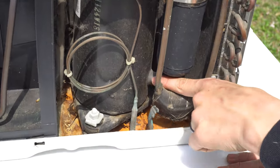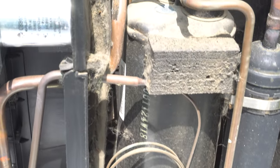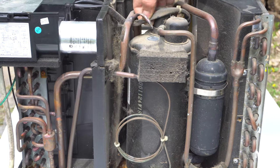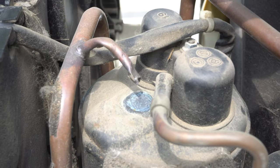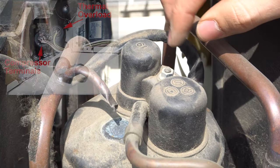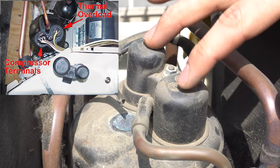You've got one pipe going into the bottom of the compressor, and then the discharge line that comes out the top. The compressor terminals — basically where the wires connect on the compressor — are right on top, and they're labeled: Start, Common, and Run. The wires are underneath here; if you wanted to access them you would need to take this bolt off, and this piece comes off so you can access those terminals if you have a meter to check the compressor with. The wire comes from the control box right over here.